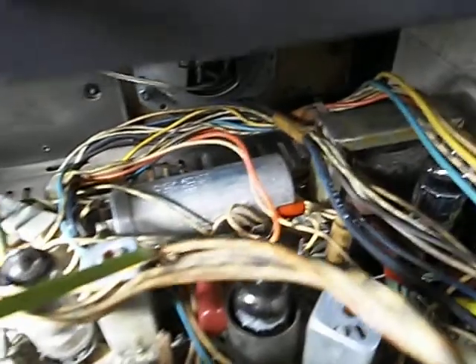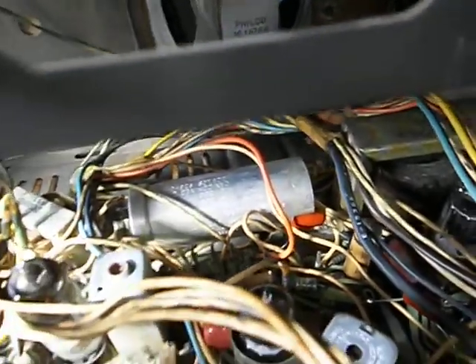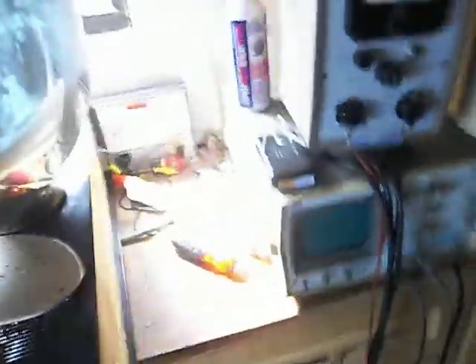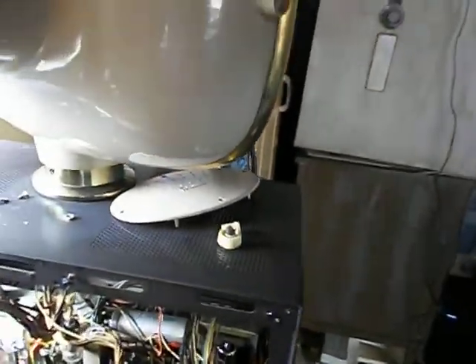There's one paper cap I'm going to point at right in here — see that one with the little white with the black ribbon on the top? I have to replace that one. That's the filter cap. I've got to do a little bit of adjusting of the positioning rings to adjust that filter.